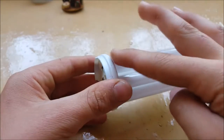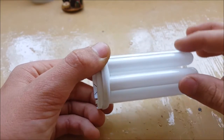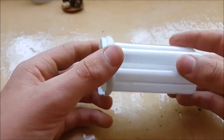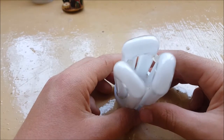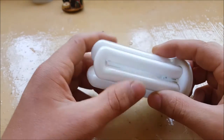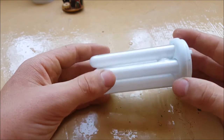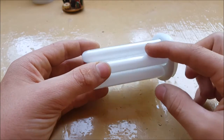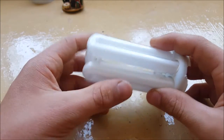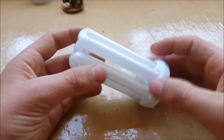After the mercury vaporizes, the negatively charged electrons in the arc start smashing into the vaporized mercury atoms, which are positively charged. When they interact, they emit UV and visible light — but mostly UV light. So that the manufacturers don't give you cancer, the bulb has a phosphor coating on it, which is the white dust on the glass. When this coating gets hit by the light, it fluoresces and converts the UV into visible light.